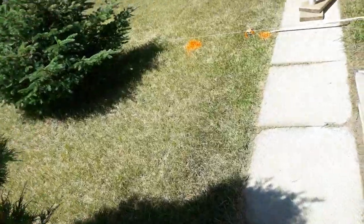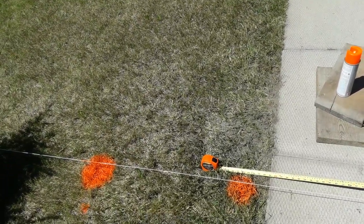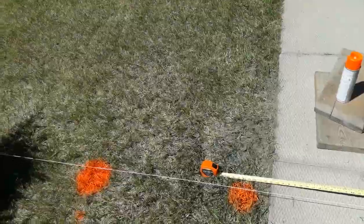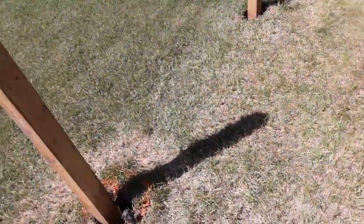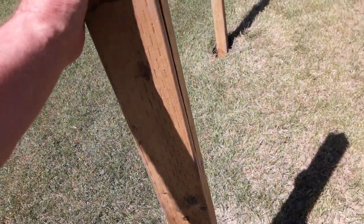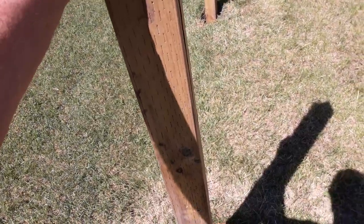I've got a busy day ahead. I'm going to try and get three posts in today. The first one killed me — that was last Friday. Then it rained for four days and my birthday was in between all that. Finally got back at it. I did two and then two more, three feet down. That's 15 feet worth of drilling at eight inches around. I'm going to use crushed gravel to stabilize them and tamp it in good and solid. If the wind wiggles it, it'll just cause it to tighten up because the gravel will wiggle. And if that happens, it'll settle a bit and you just add more gravel.